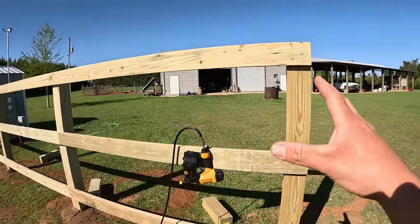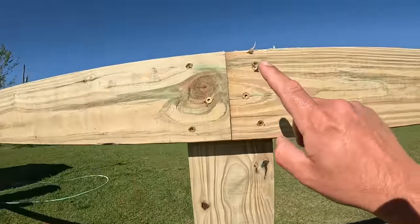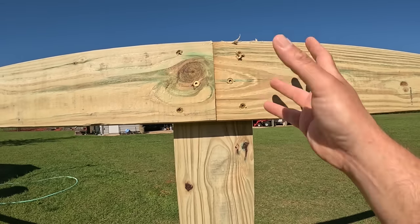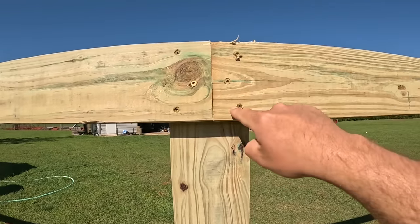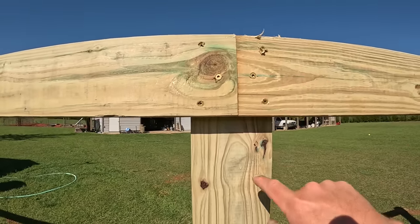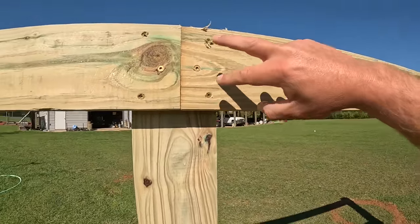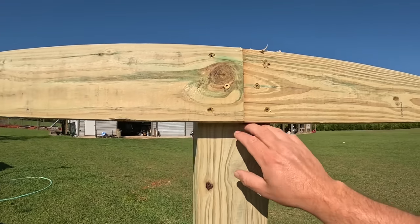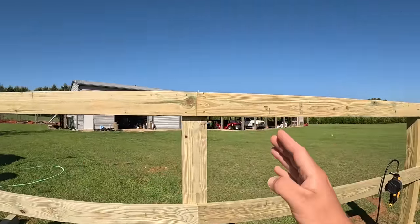Let's have a quick discussion about these runners I put up before we start putting our fence panels up. Very solid posts will help with wind resistance. I also put four-inch number-10 deck screws in — no nails — because wood will expand and contract, mostly contract down here in Florida, and you'll wind up with gaps. Nails also don't hold very well; they have a lot of shear strength but pull out easily, especially with drying wood. I went ahead and upsized to a four-inch screw going deep into the post, with three per board.